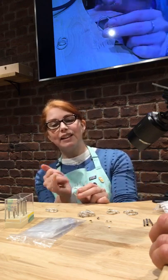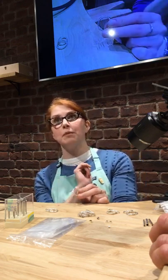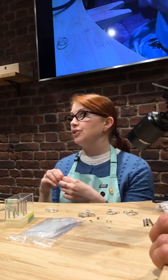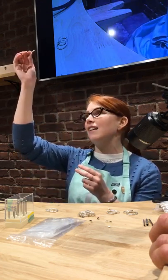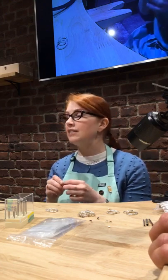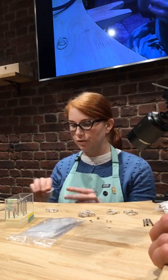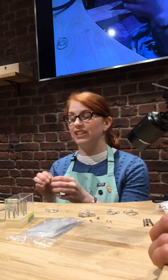There's a little, the joint is actually a V shape. It's not a nice joined up straight line. So I always check my solder joints. If you can hold it up to the light and you can see daylight through it, it's not tight enough. You need tight joints for soldering. That's one of the first rules of soldering. Tight, clean joints.